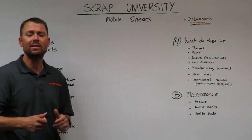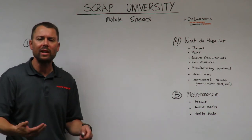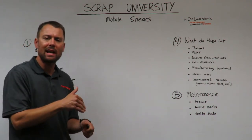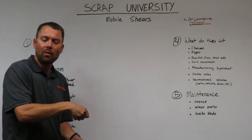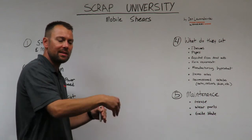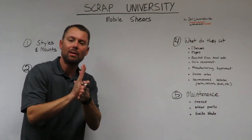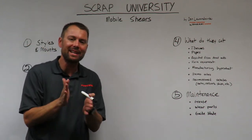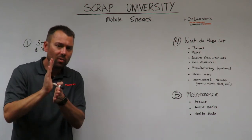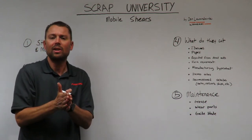The way that works is simple. The edge wears down over a period of time, on average about 80 hours per edge, so that's about 2 weeks per edge that you're going to be able to cut with that blade. But once that edge wears down to a point, and with a gauge you can measure where you're at, eventually you need to loosen the bolts, pull that blade out a bit, and pop some shims in there, shim plates of different thicknesses, and you can put more than one in at times, that bring that tolerance back nice and tight for the shear upper and lower to bypass. Because if we allow too much of a gap to be created there with wear, then we can start pulling material in and jam the shear. And shears have twice as much power closing than when they're opening, so it can be something that's easy to do if you allow that gap to be created.